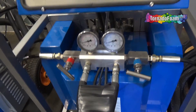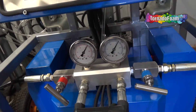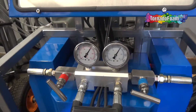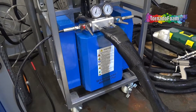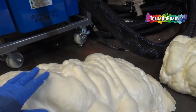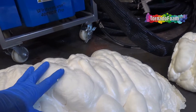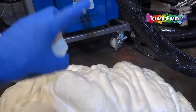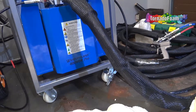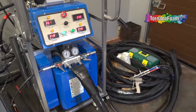After checking the pressure, we can switch the machine into high pressure mode. This machine is very powerful — the output pressure is about 150 bars. With the Winterman 400 VDR you can produce standard foam used for building insulation. You can also produce special foam which may be more flexible or harder, depending on the manufacturer. Sometimes the foam is very hard, sometimes softer, sometimes open cell, sometimes closed cell. And sometimes you can produce special foam for injection. This is because this machine has a non-standard dose ratio which can be set up prior to production.